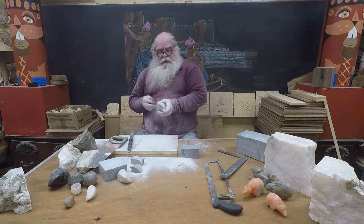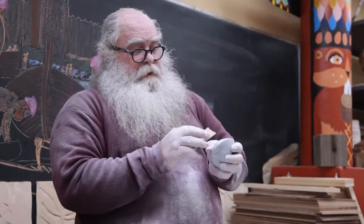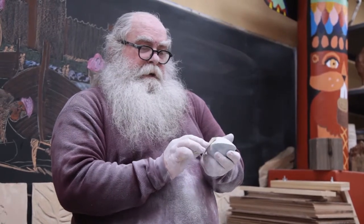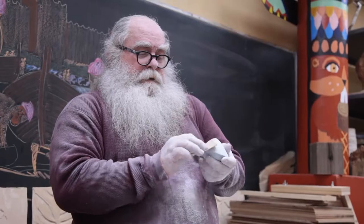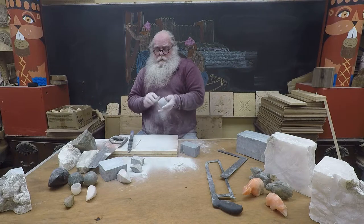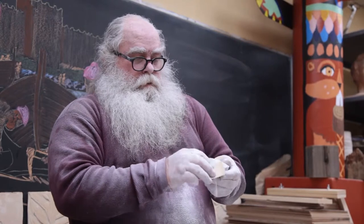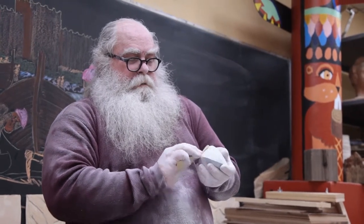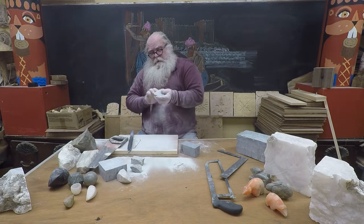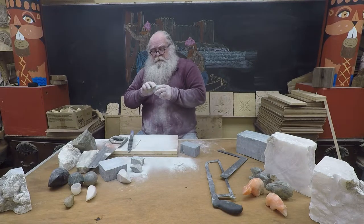But having that right proportion of the sides to the length is critical. If you don't have that proportion right, it's not going to turn out like this. It'll turn out something like this, similar, but not a true oloid. And I'm just about ready to go to the next grade sandpaper. I don't see any scratches from the rasp left. The symmetry is looking pretty good to me.